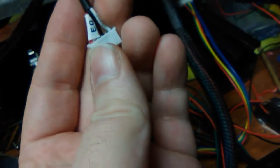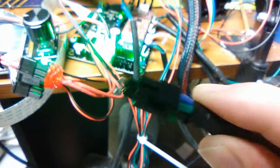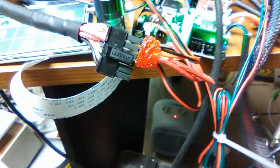These last four pins are for the extruder motor. If you wanted to use the stock extruder connector you'd just have to map it, which isn't too difficult — I used my multimeter to see which went where. I don't have the heated bed plugged in yet, but I do have pin headers soldered and ready to go, including a set for the thermistor on the last two connectors.